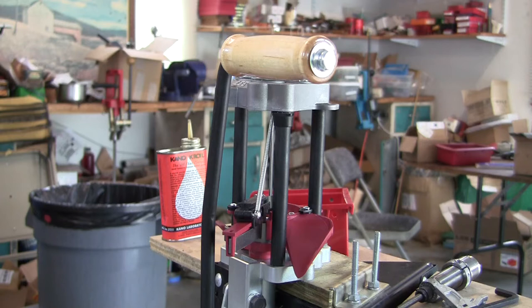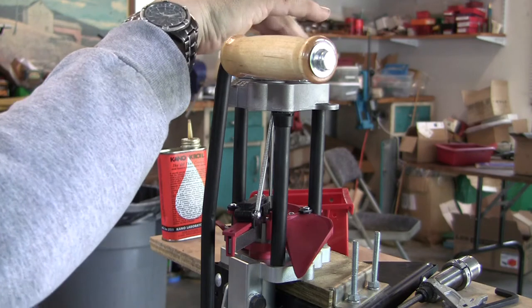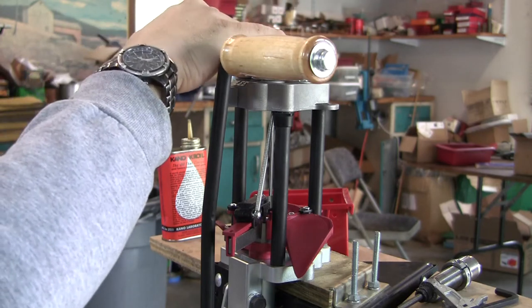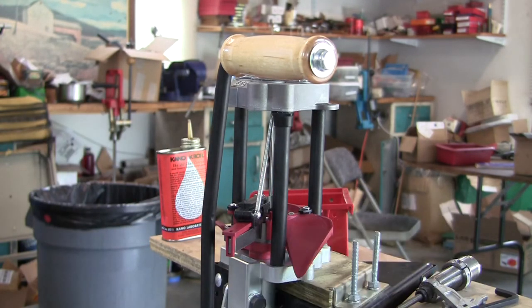Now the instructions tell you how to install a shell plate. I'm going to have to change the camera angle. What we're going to do — if you look, positions one, two, three, four — position four is where that split bushing is. I'll show you how to remove it and get this indexing rod. The indexing rod and case ejector have to be removed.